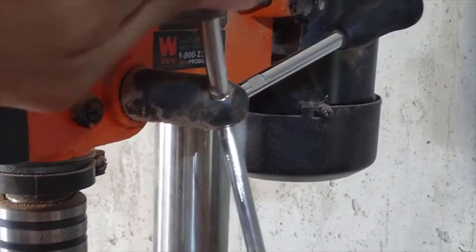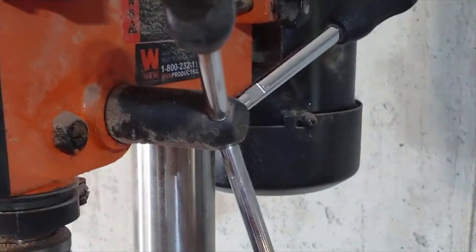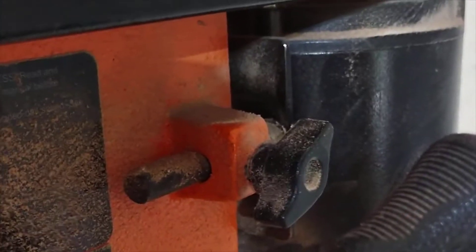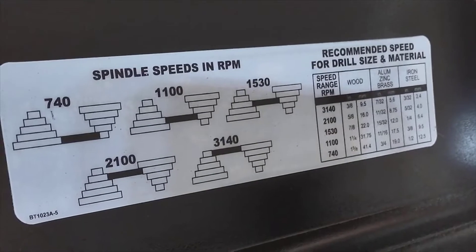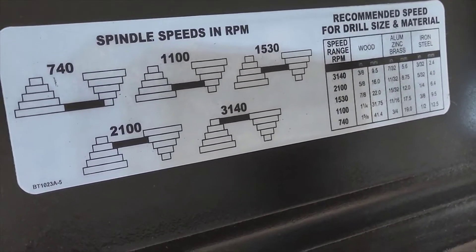See the handle here — it's pretty decent. These have come off for me in the past; they twist pretty easy, but you could always glue them — not really a problem. You pop this open easily, that's where your pulley is and that's how you change your speeds. You're going to want to take tension off with this little knob down here. You just turn that, take tension off, and you actually pull the motor itself to get slack on the pulley and move it up and down to change your speeds. It comes with a nice speed chart in there — pretty helpful, shows you exactly how to place the belt to accomplish different things.